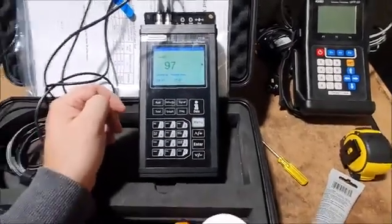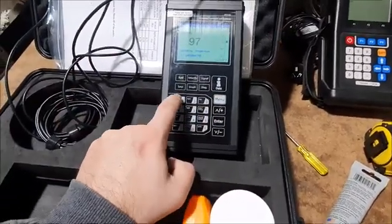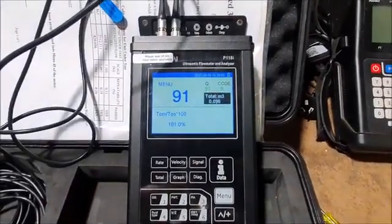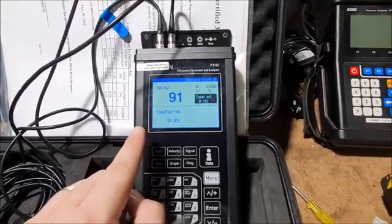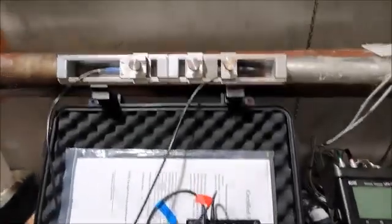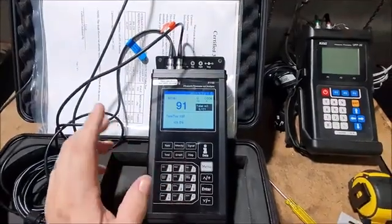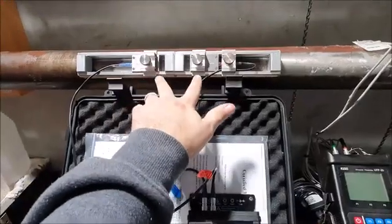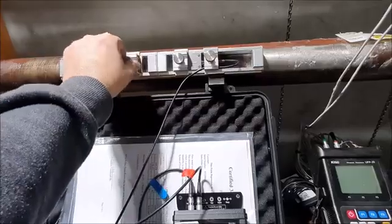And then one other value we want to look at is on menu 91. That's this percentage value. This you want within 3% of 100, so it can be in the range of 97 to 103. We're at 101, so I'm happy with that. And usually if that's out of spec, it'll be that either parameter is wrong, maybe your wall thickness you've entered incorrectly or something like that.